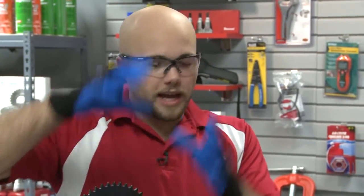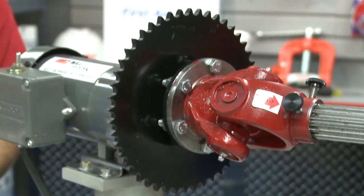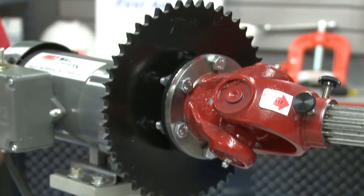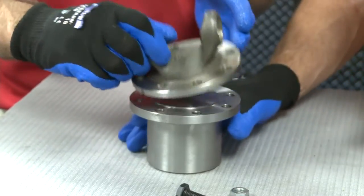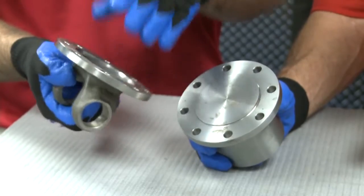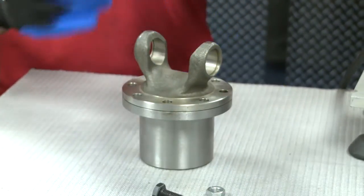Basically, I want to look at how to actually mount the drive shaft, which includes mounting on the hubs of the equipment. What we have here is a typical flange type mounting connection on a universal drive shaft. On this connection, it features equally spaced bolt holes and a fastener set that hooks it to the actual rigid hub. We're going to show that the bolts on this aren't actually what's transmitting the torque on the drive shaft. We have here a sample setup of a universal flange type joint — the flange yoke with equally spaced holes, and a piloting ring that ensures when you're mounting the assembly that it mounts properly, the holes are aligned, and you're ready to go to put your fastener set in for proper flange torque requirement.